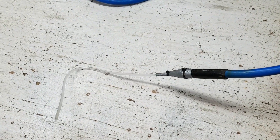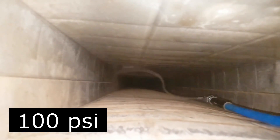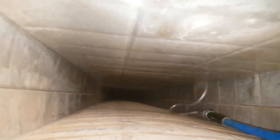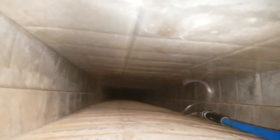Now let's try the taped whip. The single whip made from duct tape and zip ties works fine but takes a little longer to do the job. It needs to be moved from side to side in ducting that's shaped like this to get good coverage. The whip tube only occasionally visits the left side of the duct when the main body of the whip stays on the right side. Cutting it shorter and/or raising the pressure may help but its coverage may be reduced.